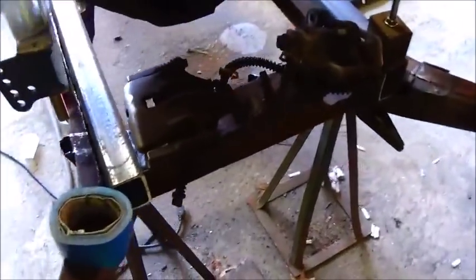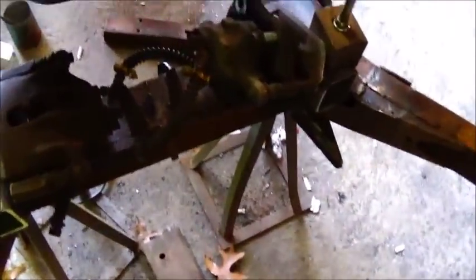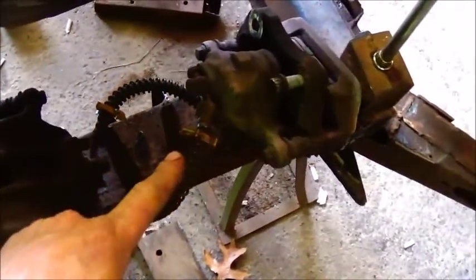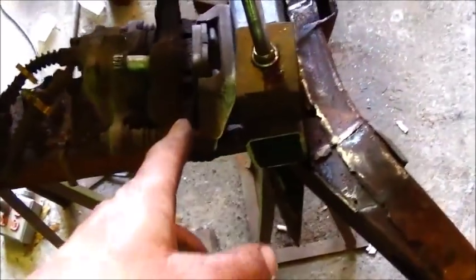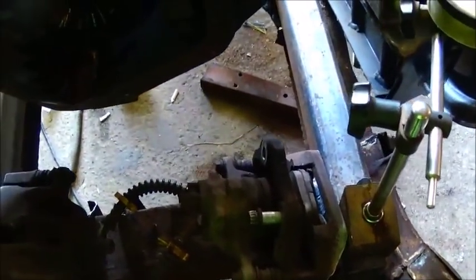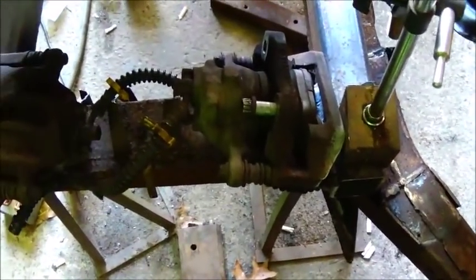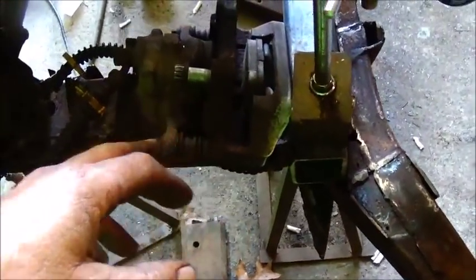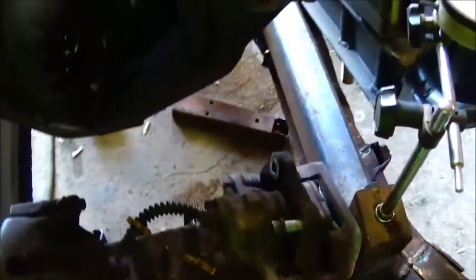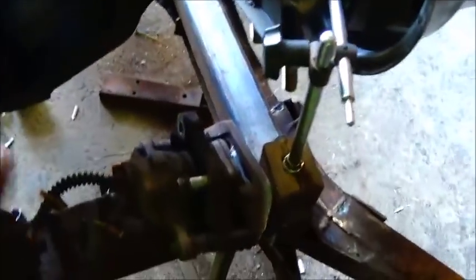Okay, folks, I just got back off that tow, and luckily Noah was here, and he pulled the calipers off for me. So we've got them. They're going to work out really well. The rotors are actually thinner on that than they are here, so we'll turn these down to what we think is the maximum. We might not even need to do that, but we'll go a little thinner. And they're going to fit in fine. Clearance wise, I don't think we're going to have any issues.